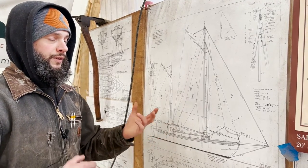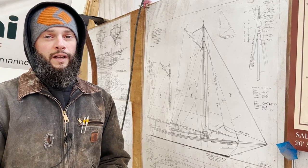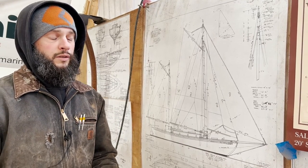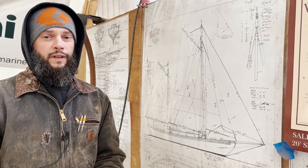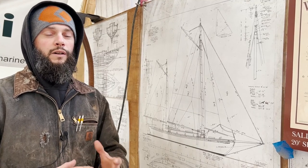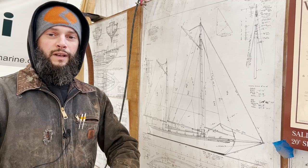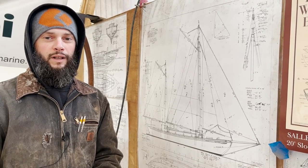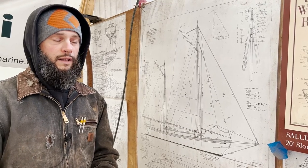Now the challenge with this, the real big challenge, is finding good galvanized wire. It's just not as common as it once was. So we need between 300 and 400 feet of galvanized wire, 3/8 inch diameter, and the construction of the wire should be 7 by 7. So yet again, this information's on the website with pictures and all the information that you need. That is in the description below where you can find all that.